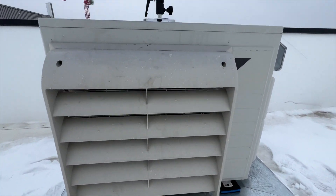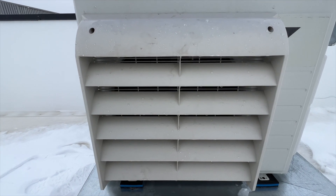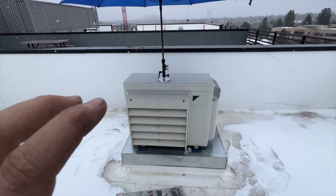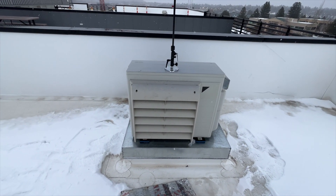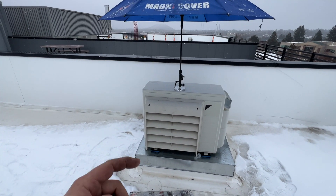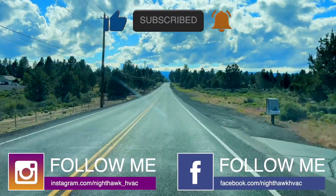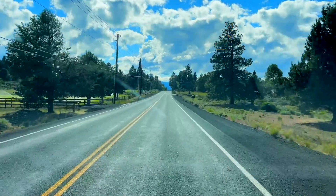She's back up and running — it is running and it's nice and silent, so we should be good to go. So if you ever come across a situation where every time it snows or gets ice on it the fan blade is loose and you end up having to tighten it — take it off and make sure the shaft didn't bore out the middle of the hub, because otherwise it's just going to keep happening. Hopefully this helps — thanks for watching, make sure you like and subscribe, comment, hit that bell notification, and follow me on Instagram and Facebook. We'll see you next time.